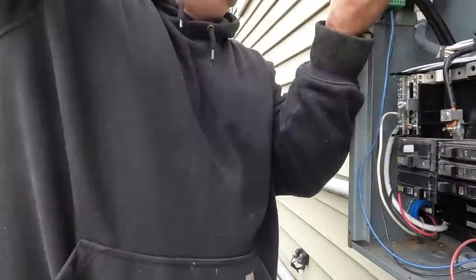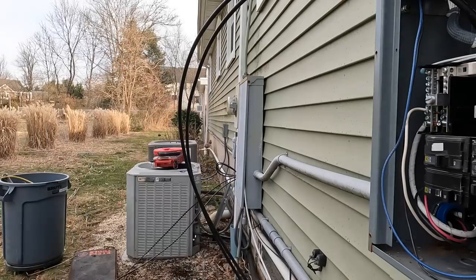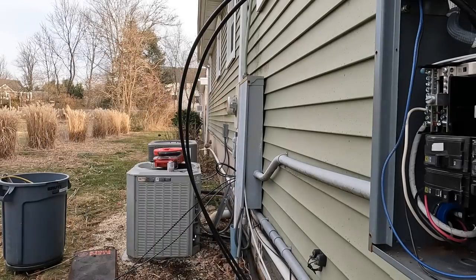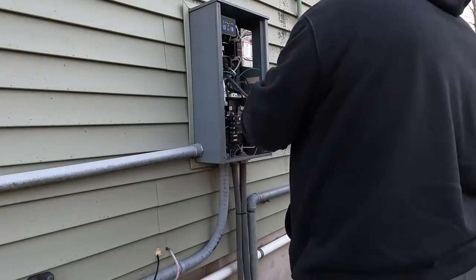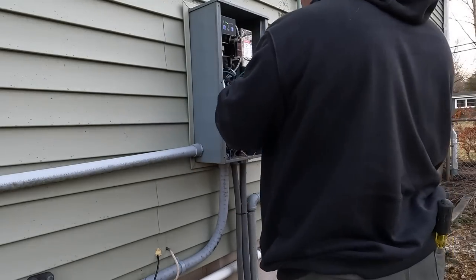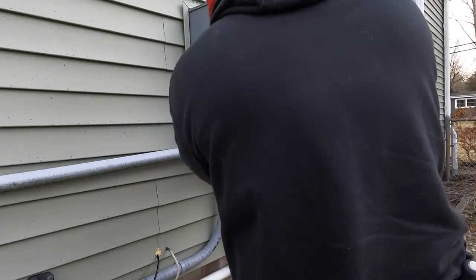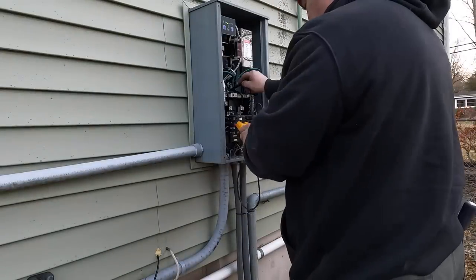Sleeving this wire up and pushing the aluminum into the LB in the inch-and-a-quarter PVC just took a little while. Whenever I'm re-identifying conductors like I am in this transfer switch, I don't like to just put one or two pieces of green or white tape around it — I like to fully identify the conductor so there's no doubt which is the grounded neutral and which is the equipment grounding conductor. A lot of guys don't do that, but that's their business.